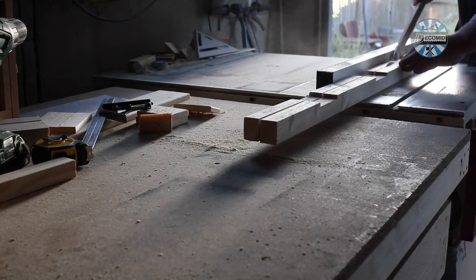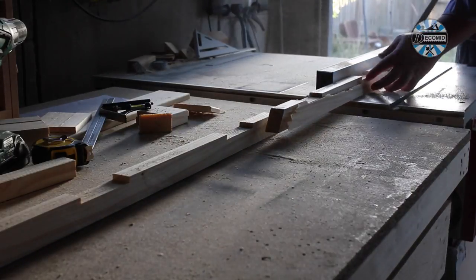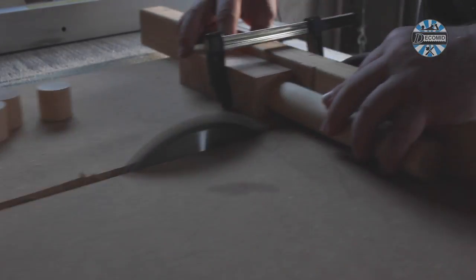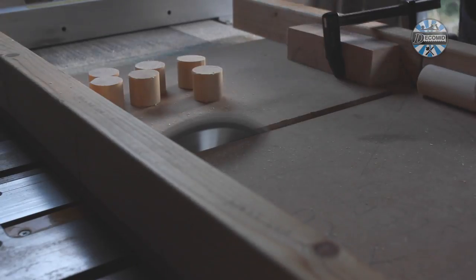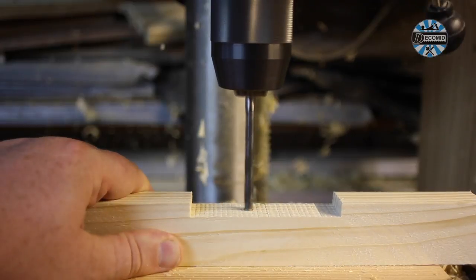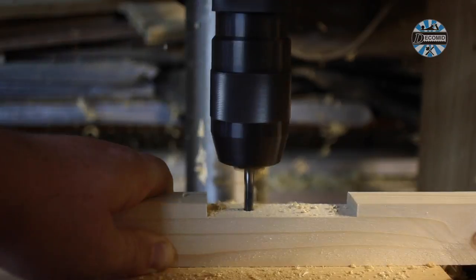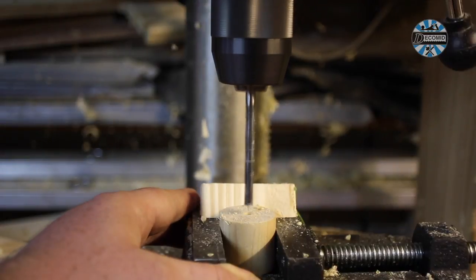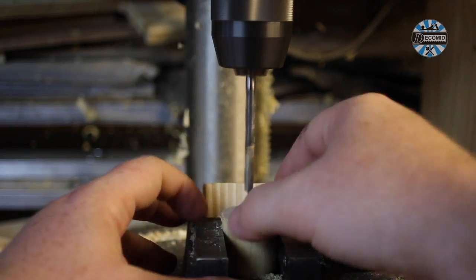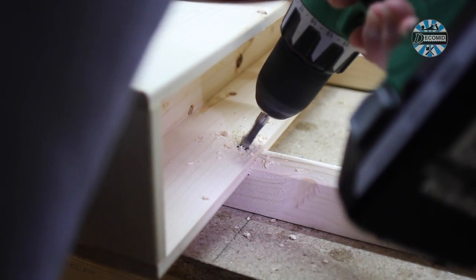The batten is then cut lengthwise into two equal pieces. I messed up the measuring so I had to trim the second part down a little, but no harm done. The frame wants to sit away from the wall so here I'm cutting riser blocks from 40mm dowel. The batten and the blocks need drilling so the frame can be secured to the wall. I chose to put these in the housings to make the final appearance a little neater. Drilling slanted holes to accommodate dowels allows the trays to be neatly held in place.